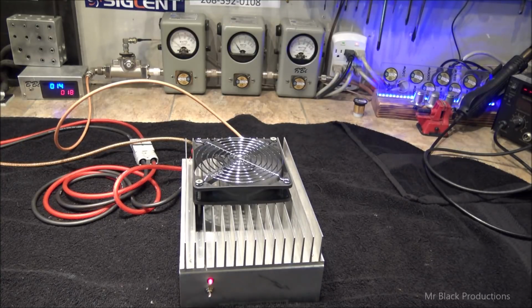So what have we done in this video? Well, we repaired the pass-through, which was blown up. We changed the transistors, which we had one of those that was bad. We looked at it on a spectrum analyzer, nice and clean. So we've demonstrated to the customer that they have the ability to talk through, have the ability to listen through, and we have the ability to talk into, and we have the ability to drive out.